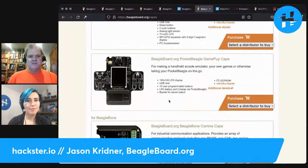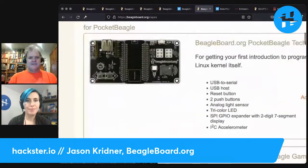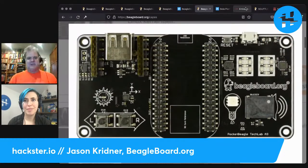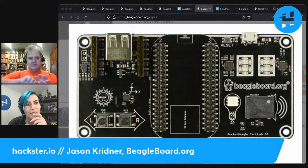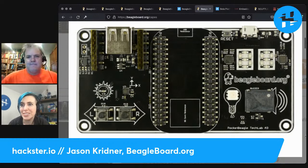That EL course, right? If you go up to that tech lab, that's the main teaching tool for the EL, right? So it's all about having something to target each of the different expansion buses. The LEDs are actually over SPI. It's an SPI based GPIO expander, so you can learn about interfacing with SPI. And they're set up as a little 7-segment interface. Love it. Yeah.